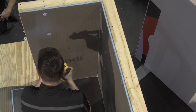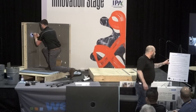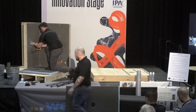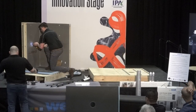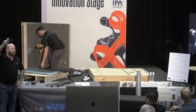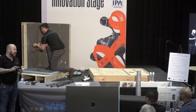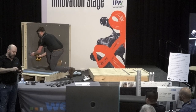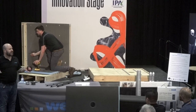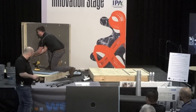Back to the Click and Seal items as Greg finishes the screws and washers. Once the drain is assembled later in the process, we have an extension kit for the drain cover — very easy, you can screw it up and down for height adjustment. One of the innovative items this year is lateral movement so you can get the perfect grout joint in case the tile layout is slightly off.